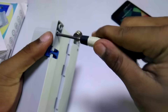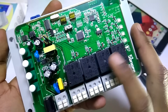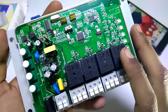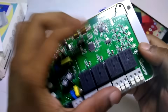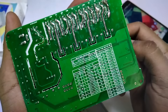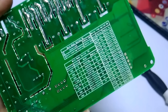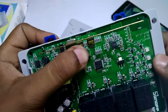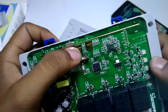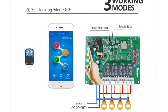I'll now open this device — there are four screws on the backside. Inside you can see four individual relays for the four channels, and the PCB construction is very good. On the backside they have kept cutouts between the relays. On the bottom you'll see a table for the K6 timing switch to set the delay, and on the front there are three switches for modes: K5, S6, and K6.